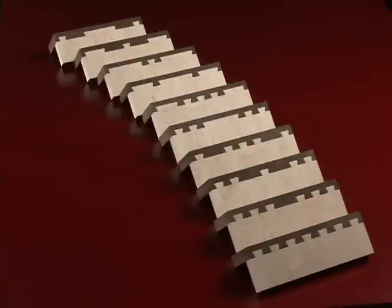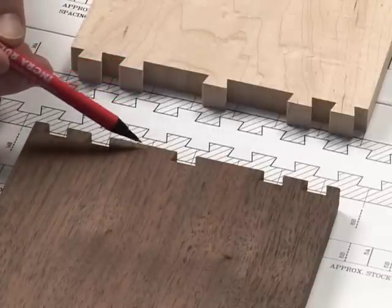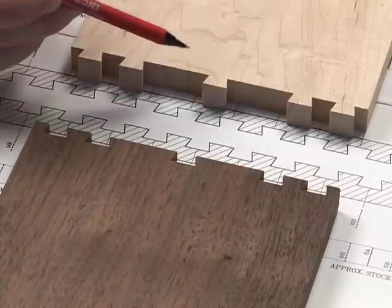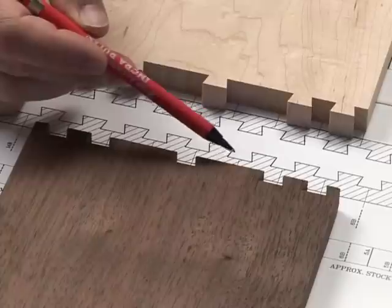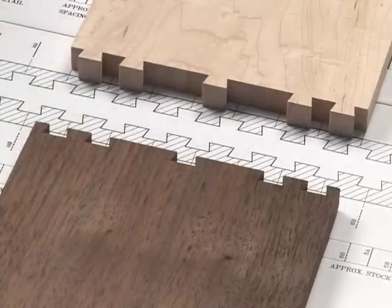The variations technique is really quite simple. By leaving cuts out when producing one side of a joint, and then using the drop cuts on the other side, you can modify the look of an existing template. Let's take a look at a few examples.